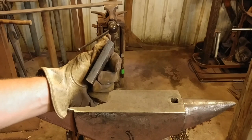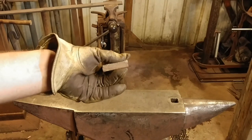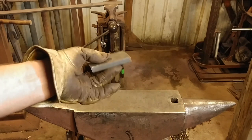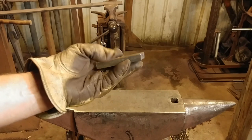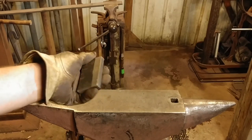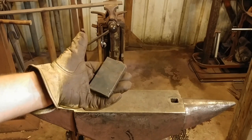This piece is going to be for the base. I've got the knot tied and it's cooling down. We're going to be using a piece of half inch thick, two inches wide by three and a half inches long flat bar mild steel stock. Just like in my texturing base video, we're going to go ahead and texture this thing all up. This is just a piece of scrap that was laying around. We're going to beat out the edges and give it a decorative border, then drill it and attach the knot to it.